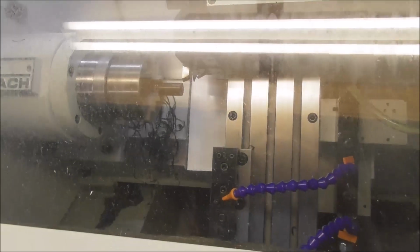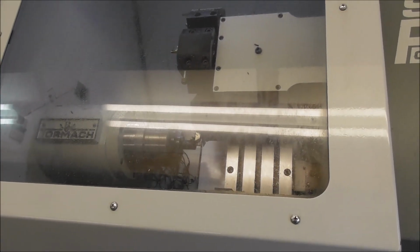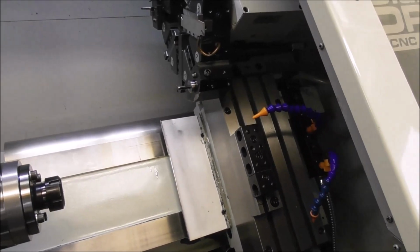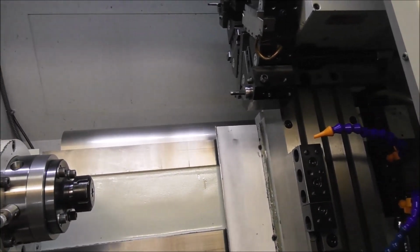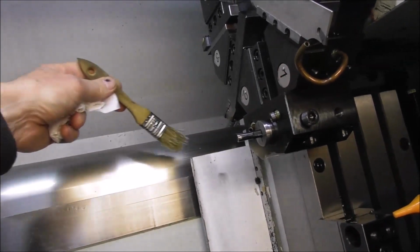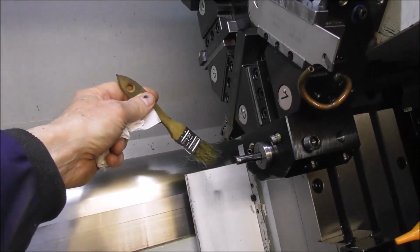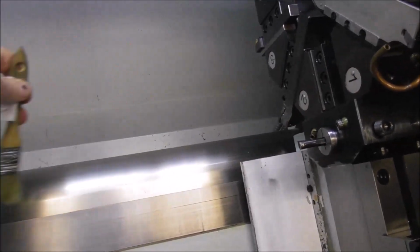and you need to do a backup of manual cleaning and lubricating. So the way to protect your machine is to have a backup plan. Think of the areas that are highly vulnerable to wear, for example, this area in the Slant Pro. So regularly brush the chips, because they gather there, they fire there, and they build up in a pile there, and they become pressurized on the slideway. So regularly brush them out,